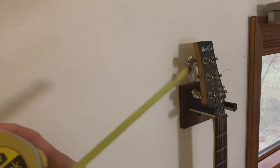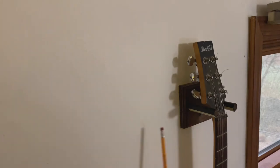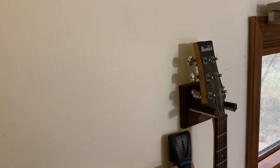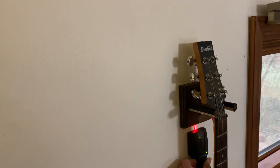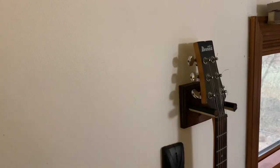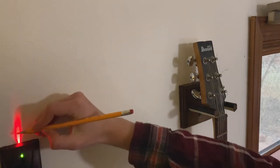Let's do it. To mount this securely on the wall, there are several important tools. First off, the measuring tape, which makes this a lot easier. Stud finder. Now, when building a house, every stud is put 16 inches apart. So that means that there's going to be another stud somewhere over here. That's where we're going to drill the screws. So as you can see right here, this is where it hits the middle of the stud. So that means that somewhere over here, right there,